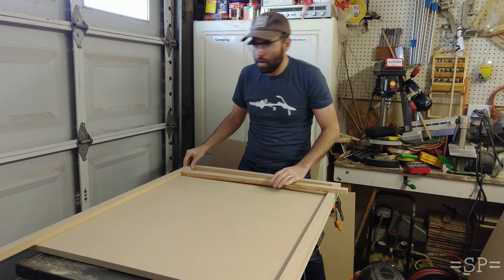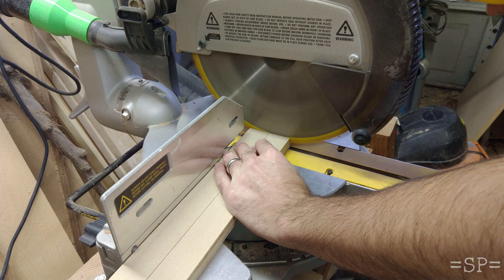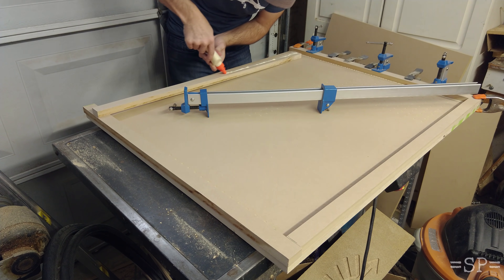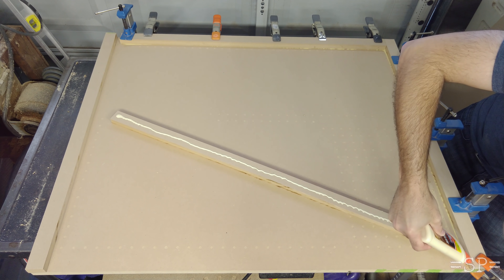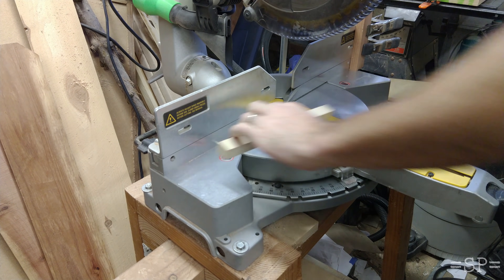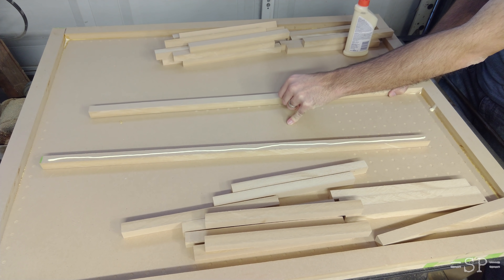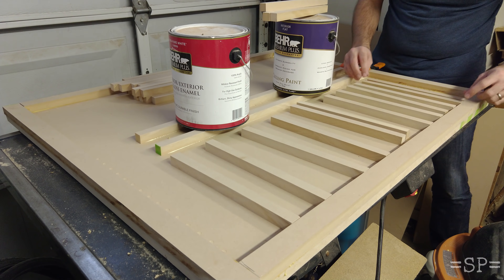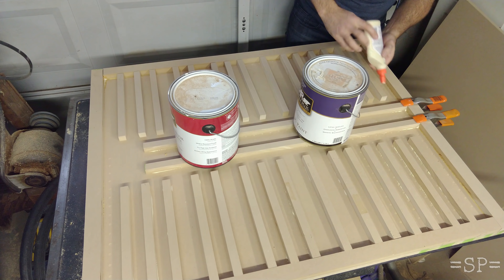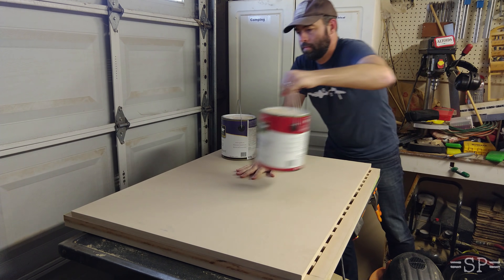Now we need to build a frame that's going to sit in between the top and the bottom — this is where the vacuum is going to be pulled in from the top. I started with a couple of 1½ inch pieces of MDF that I'd cut and glued into an external frame. We want to make sure you use a lot of glue on here because this is intended to be airtight. I also made a number of internal supports that would sit in between the top and the bottom, but still allow the vacuum and air to pull through the whole table. Some people do different segments that they can hook up to different valves or pumps, but for this one I was just wanting one big one and it worked out well that way.